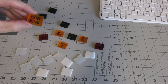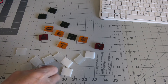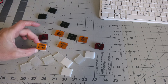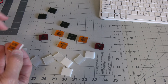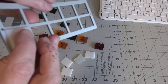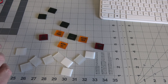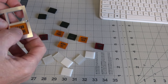So we've got our buttons clear coated and we have our two sets — colored and clear. The next step is to assemble the buttons: there's a button and then a backing plate that goes over it. If you put the button on the backing plate, you can see it just has a very small border around it. When it goes into the actual frame, the little backing plate being just a little bit bigger than the button is what holds it from falling out the front. If you're using static buttons, you need to do that so they don't fall out. If you're using active buttons, there's going to be another button behind here that you push on to make this go in and out. Either way, you have to assemble these buttons.